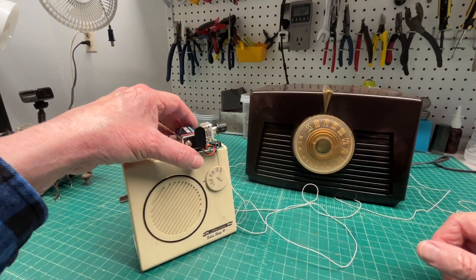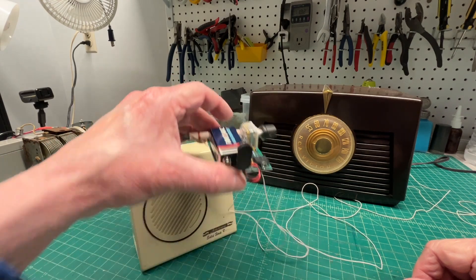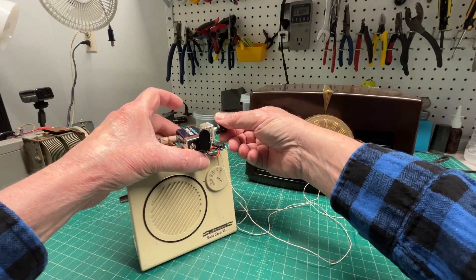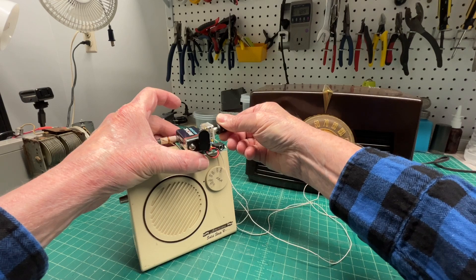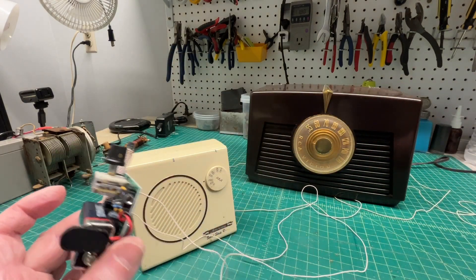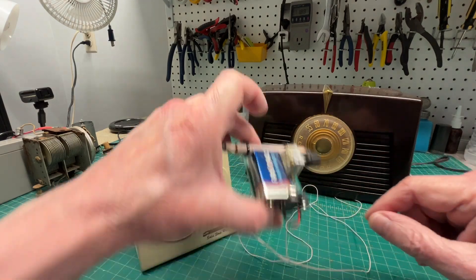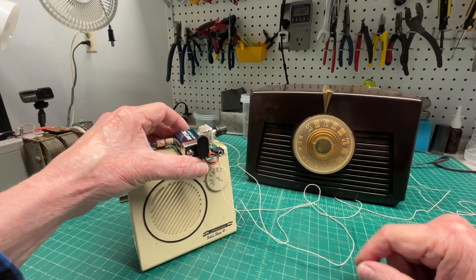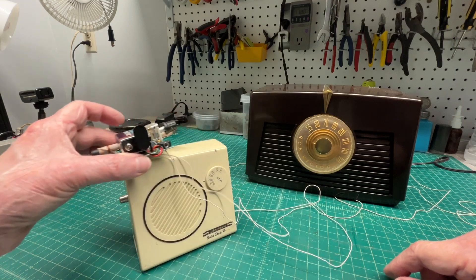Just using the circuit for a ferrite antenna booster in close proximity to the existing receiver. You can see adjusting the variable capacitor, which creates a tank circuit there. It resonates across the entire AM band using the ferrite antenna, and you adjust for the highest amount of signal strength. So that comes in handy as well — kind of an all-purpose close proximity AM transmitter.